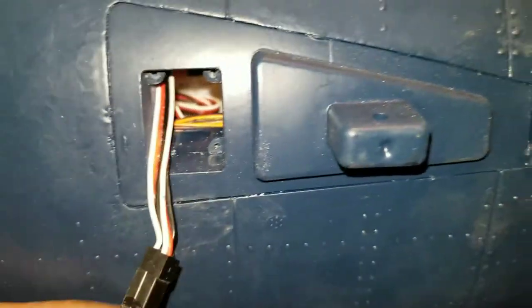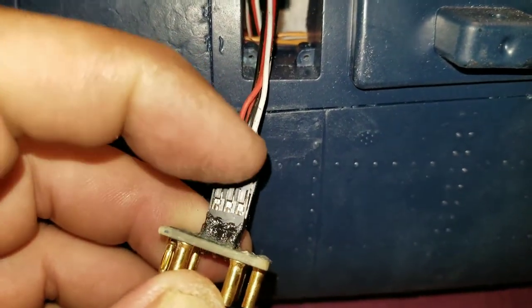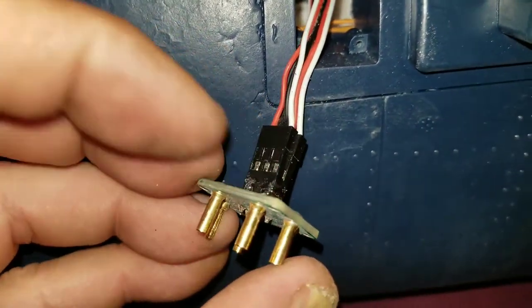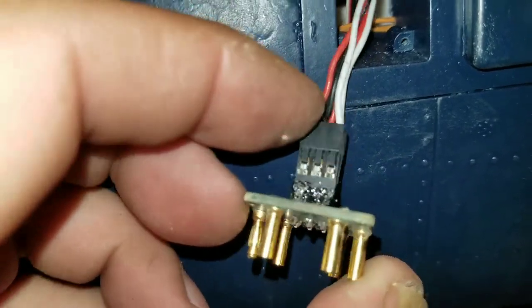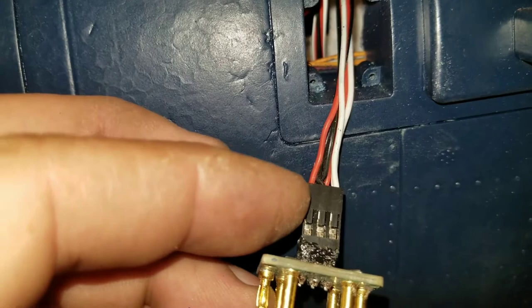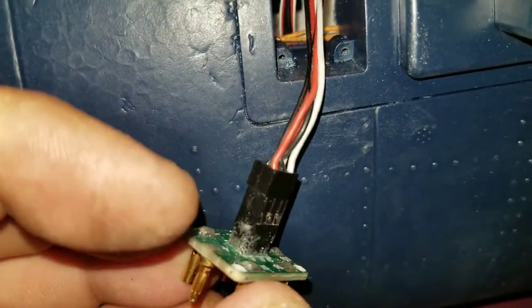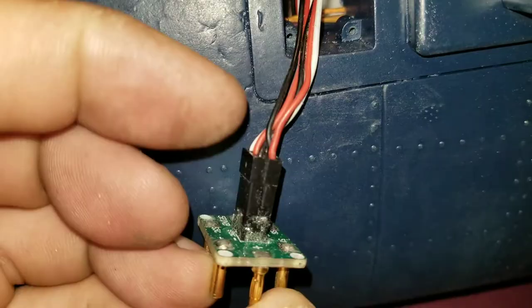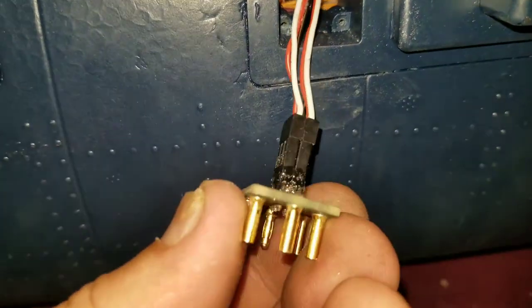Rich also posted a video with a tip on how to make these pins fit better and more secure on the pins they plug into, so you have a stronger electrical connection. That's a really good tip — I do it to all mine. When you get pins like this, make sure the little tangs inside that make the pin connection actually have a dent, and adding a little more to it helps ensure a nice tight snug fit. Secure the whole connector down. Note that the wiring is red, black, and the blacks are crossed between the two connectors because this feeds a bus board.